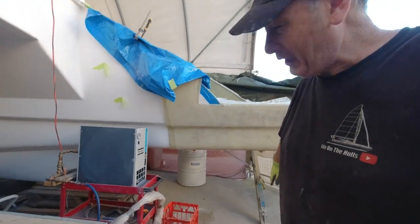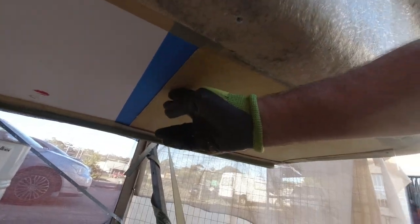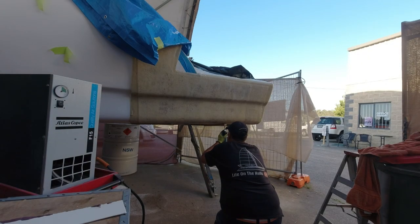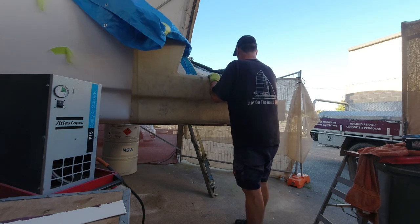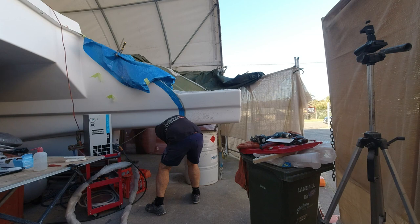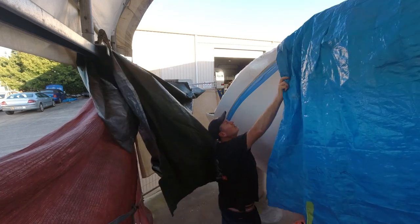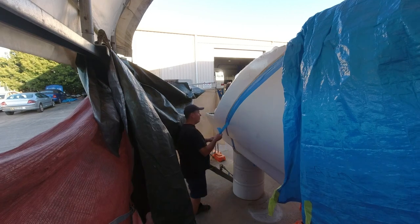The mold needs to peel down and away to come off. You can see under here where it's gripping at the base plate — probably some resin holding it, but it has got release agent so it should come off. Coming up right now — the demolding of the hull extension actually wasn't captured on film; the battery went flat just as I pulled it off. I realized I'd denied Janet the chance to watch it too, so I'm in the dog box. I do promise to bring you the demolding of the port-side hull extension on film.